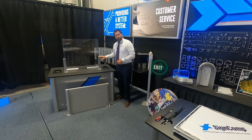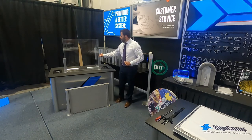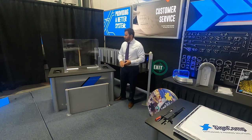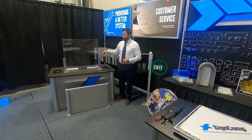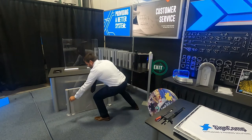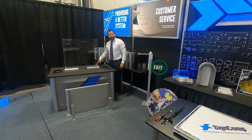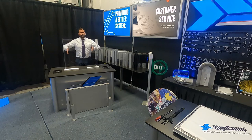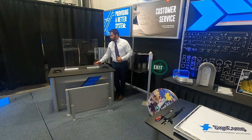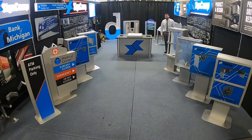Next we utilized our architectural product line — our two-by-two square post. We actually routed out the cap to match the thickness of the acrylic and suspended it past the post, so the post doesn't run all the way to the top and reduce visibility. Keep in mind we can cut this to whatever height we'd like. Lastly, out of our standard line, we went with our edge lit extrusion — doing a wrap-around so it's concealed and gives full coverage for sneeze protection. We just put a simple miter cut with half-inch acrylic. You can also route it out or make a little speaker box.